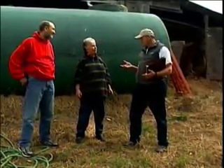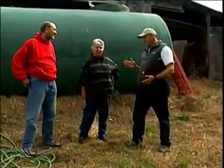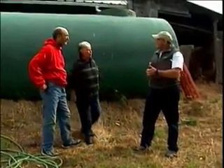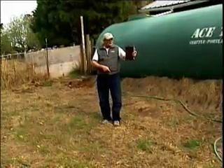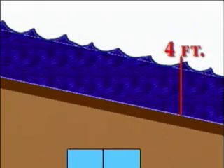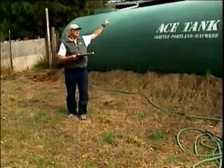The well runs out of water, you don't want to spend $25 a foot or more to put in a new well, and you don't know how deep that well is going to be — it could be as much as six to eight hundred feet. Now, this roof here: I'm going to pace off a 20-foot section. A 20 by 20-foot section on that roof would receive anywhere from 48 to 60 inches of rainfall here in the Oregon City, Clackamas County area. That's equivalent to over 12,000 gallons of water — a 20 by 20-foot section on this roof would fill up that tank.